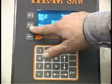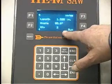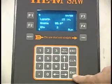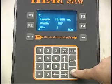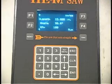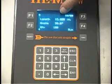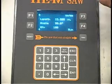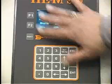That uses the four different keys from the main menu. You can run a quick job and it'll remember what the last quick job was. If you want to change the length, let's say we've got a different job — 12 inches, 90-degree cut, and we need 100 parts. Push run and that's programming. Sometimes you hate to say this is programming, because it's not really data entry — it's telling the saw what you want it to do: cut 100 parts, 90 degrees, 12 inches long. People hear the word 'programming' and think they need a computer science background, but you do it all with these keys.